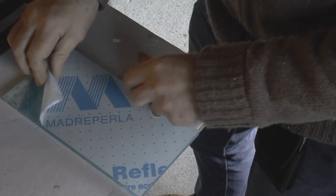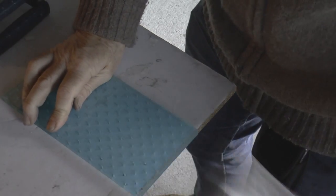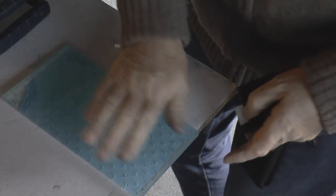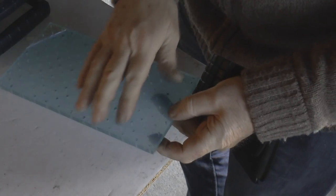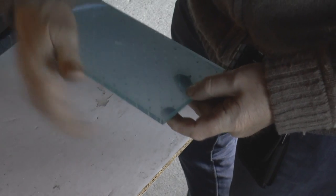This time we are tackling maybe two problems — or not problems but weaknesses — that I discovered before. First of all, we noticed that this plate sagged in the middle. What actually happened is the top surface, when it gets cut, tends to curl the top up and leave the bottom sagging.